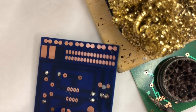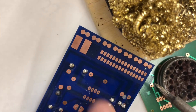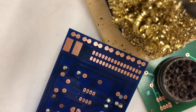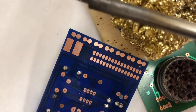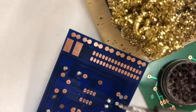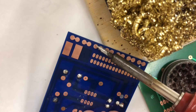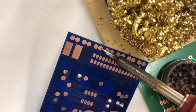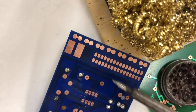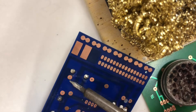Make sure it's steady. You should be starting with an empty board; I'm starting with one that has parts in already so I can give you some demonstrations. Just as before, we're going to clean the soldering iron and make sure it's super shiny, add a little flux, and then solder these in. This metal contact connecting to another looks like a short circuit — these practice pads are shaped like that.